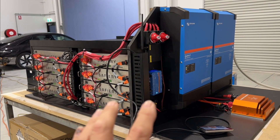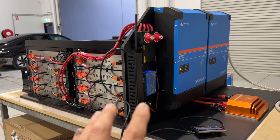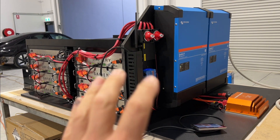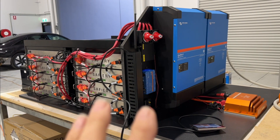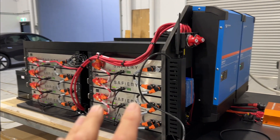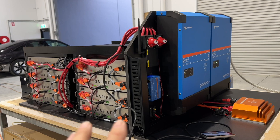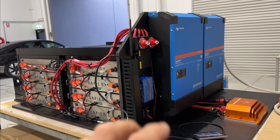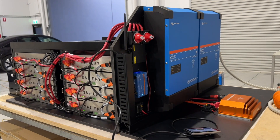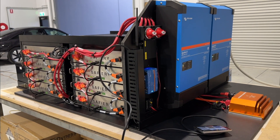We can charge this in about one hour — it will just pour the 40 kilowatt-hours in in one hour and totally charge it. So if it's on a mine site it just stays there, and you just shuttle charge it for one hour, brings all the batteries back up, and then it can run overnight. This is designed to run for several days, and during that time it's going to be replenished on the DC side in the long term and on the AC side in the short term. How good's that!